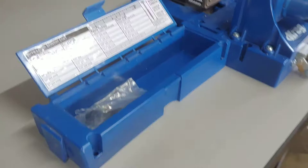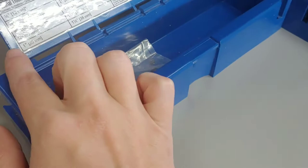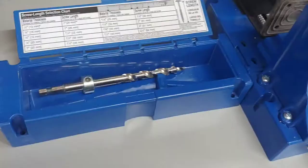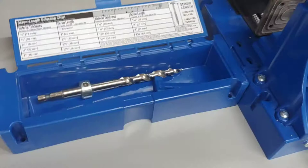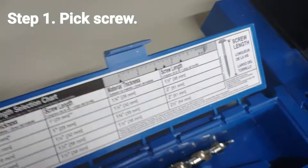The other thing that I love about these little storage wings is this screw chart, which is just a really great reference point for what type of screw to use given your material thickness — it comes in super handy. So step one is to determine your screw length and type. This is what I always refer to when I'm picking out my screws. You want to know what material you are screwing into, and I am using three-quarter inch pieces right now.